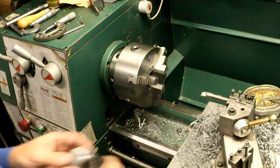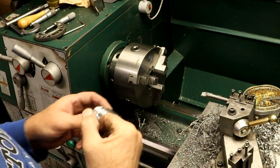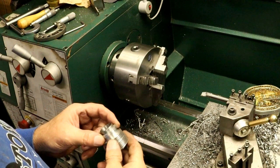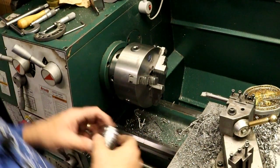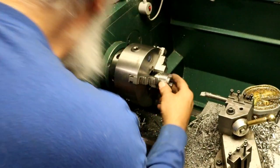I got it pushed into place. Now I want to take the face off the front, finish the bore, and then flip it around and just take a light skim on that. Now I want to see if it will locate in here okay, or if I'm going to have to make a holding fixture for it.